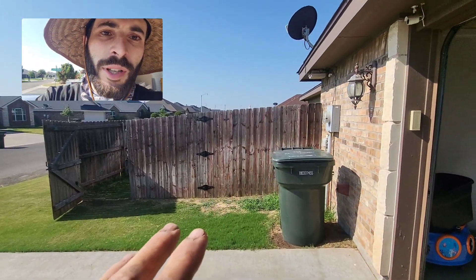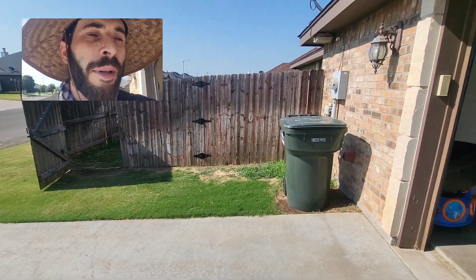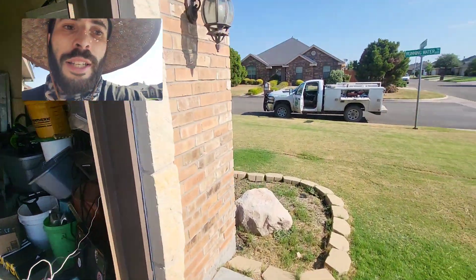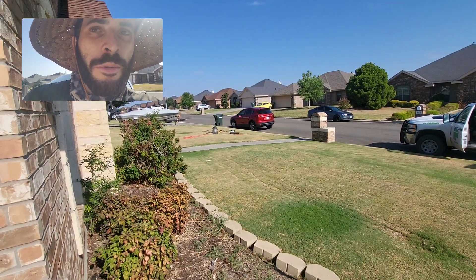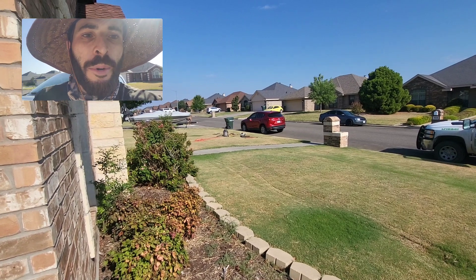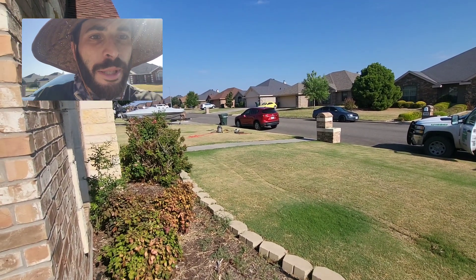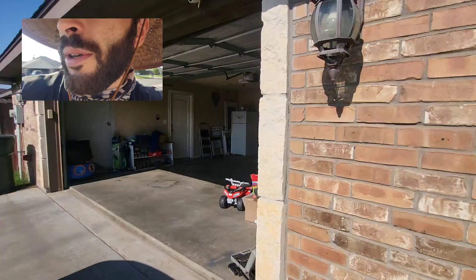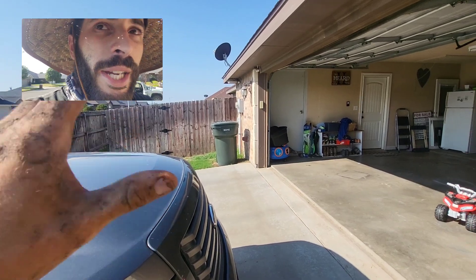When I went to the back, I didn't turn the water off — I started cutting into the main line and water started coming out of the pipe. I went to the front yard and looked at the water meter to confirm we were using water, and we were — about 0.48 gallons per minute. At that point I knew the master valve had failed; it was allowing water to pass through.